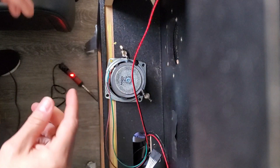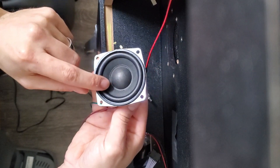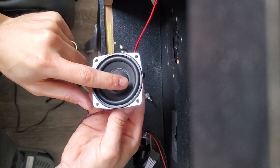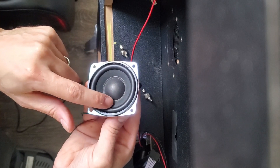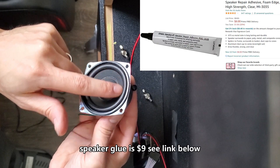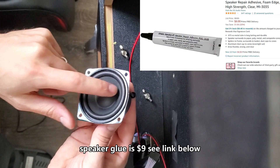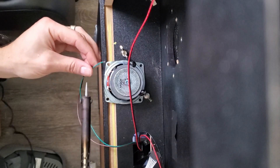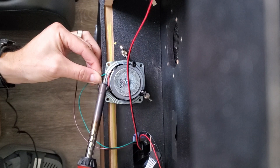Now the speaker itself could be good and you could have a tear in the paper — you can physically take a look by pushing on it right here. You'll see if there's any tears alongside within the ring. There's a ring here and the inner ring, and there's no tears so we're good. And if you want to solder the new speaker back on, you just do that.